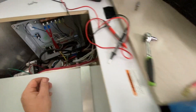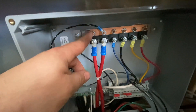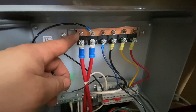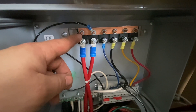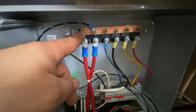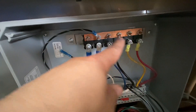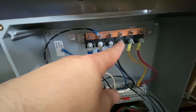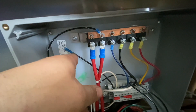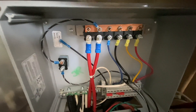I've even seen it fused at a hundred. What I plan on doing to protect it is just tap it onto the main bus bar here. The reason I think I can do that without a problem is that the solar charger can never physically push enough power to overload that wire. The only thing we have to worry about is all the other stuff on there, but all that stuff is already protected with breakers. These are thermal breakers — the battery is on one, the main is on one. So if I just tie right into this one, it's protected by default everywhere else. That's what makes sense to me.